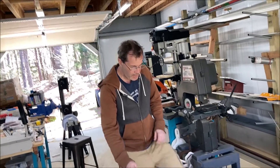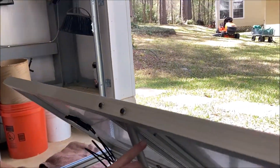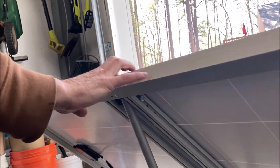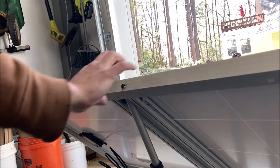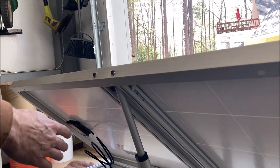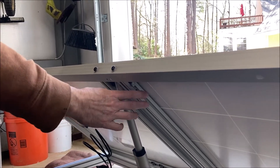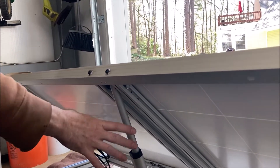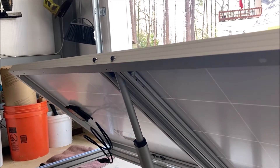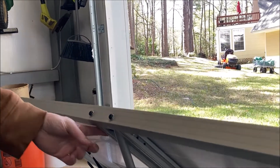If you look back behind the panels, I've built an 80-20 frame underneath and the panel goes around that. Without this panel on here, this whole assembly still works — I didn't want to rely on the panel for any mechanical load. This frame underneath is what takes all the stresses. See the big bolt here? It's a 5-inch, 1/4-20 bolt with a stainless lock nut on it.